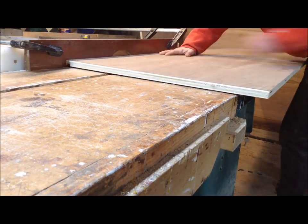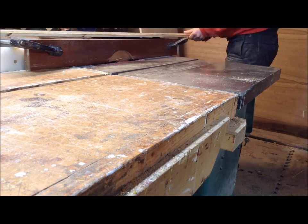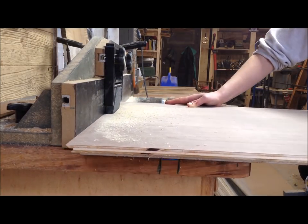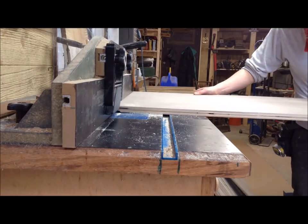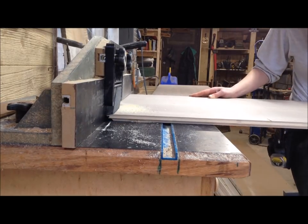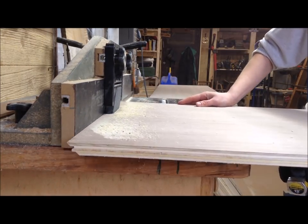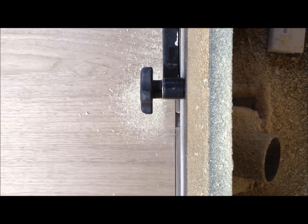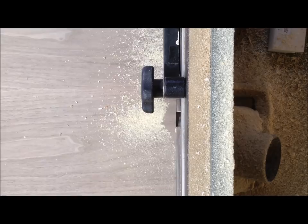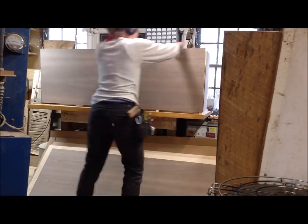To join these miters together, I used a router bit that makes a lock miter. I'm only showing that sped up in this video because I actually made an entire separate video showing how to use this bit and assemble the carcass — if you want to learn how I did this, which you can use for any mitered box or joint, check out that video on my page. I've used other methods before and I like this one best. Even though this carcass ended up being really big and still needed clamps, on smaller pieces the lock miter really holds the joint together practically by itself.